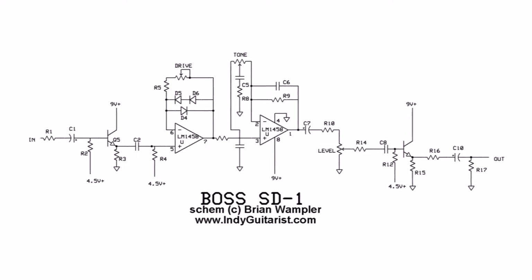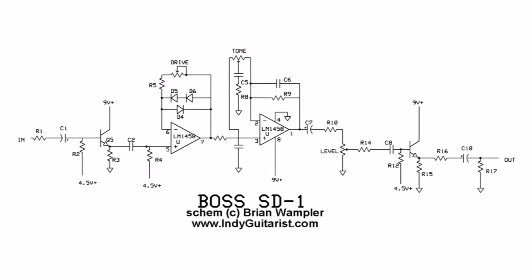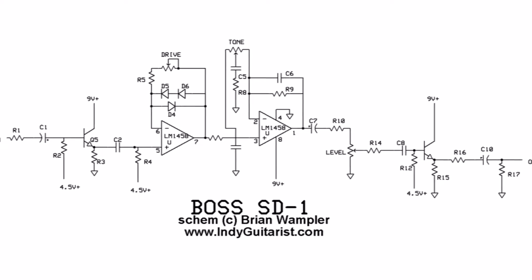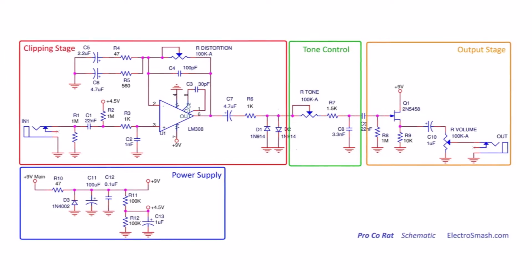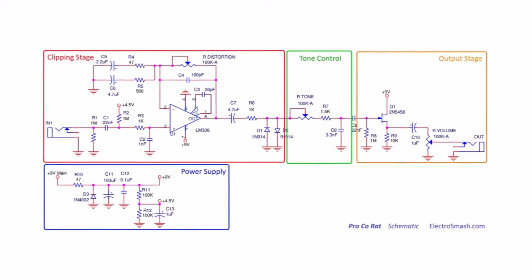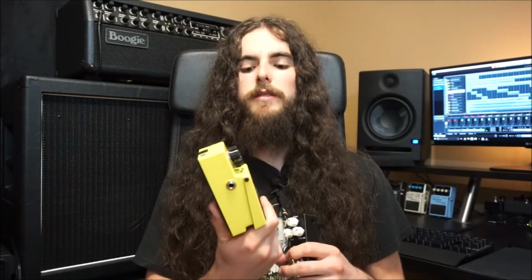So there's only so many ways that you can get an audibly nice distortion sound, and it's really about where you place clipping diodes in the signal chain. For your run-of-the-mill Tube Screamer lookalike, those clipping diodes are placed in the feedback portion of an operational amplifier, while on a hard clipping pedal like this, the diodes are placed in the output section of the op amp. And so you get a much grainier, much softer distortion quality with something like this, even in the asymmetrical setup, versus a hard clipping pedal like this, or the MXR Distortion Plus, or the mini pedals that came after it.